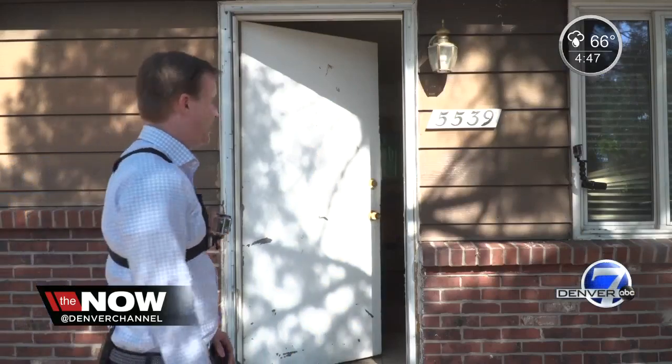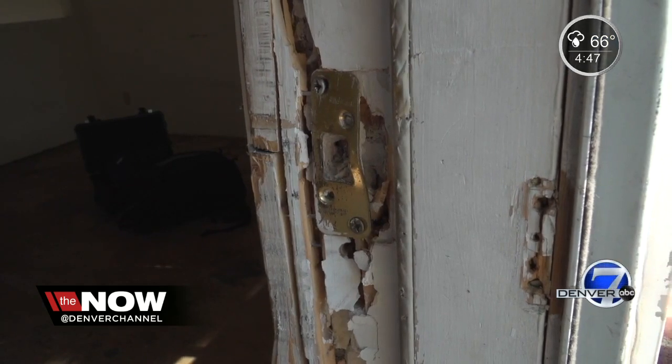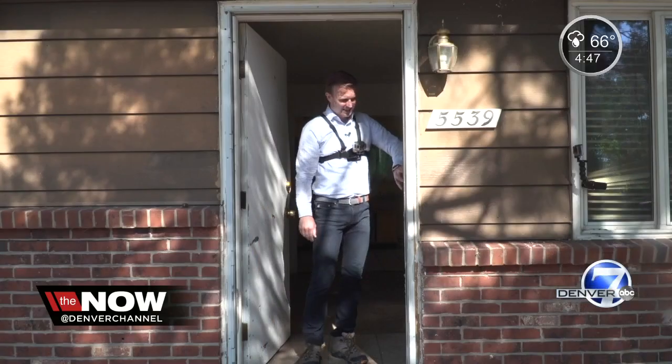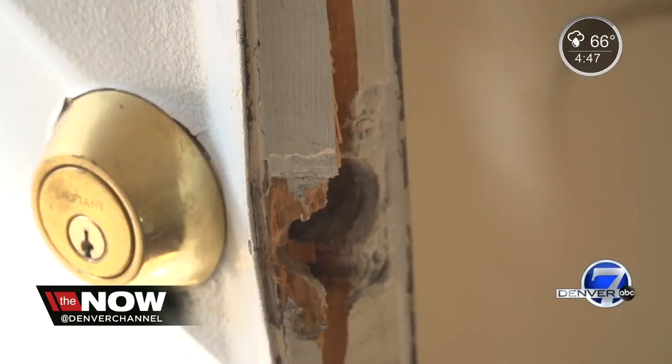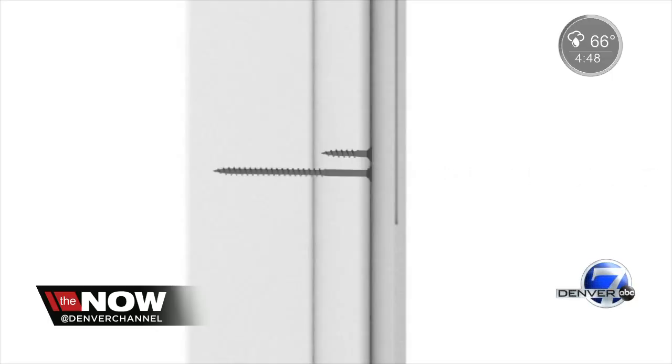So that was a lot harder. And if you look here, the plate actually stayed — those screws held that plate in. It's not even the screws that came out; it's the whole deadbolt that ripped out of the door. When you put the longer screws in, you're actually going into the framing of the house, and it can withstand a lot of stress. That's why the longer screws would be really helpful in securing your house.